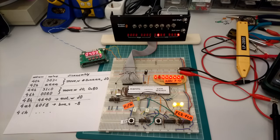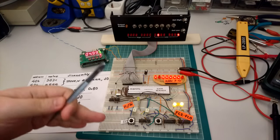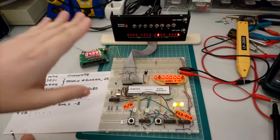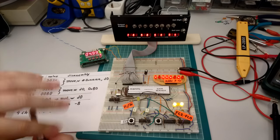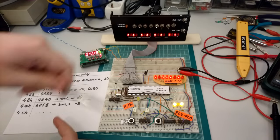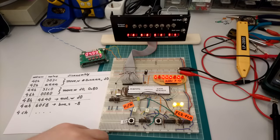What happens is that while entering an exception handling procedure, the CPU will push a bunch of values onto the stack to save the context of execution at that point, so that after handling the exception, if we have a full operating system running on this thing, we could still go back and continue the execution of our program. In this case, I'm just going to fast forward through this because it's going to store a lot of values into the stack. So another store, you see that it actually stores the registers. That should be the value of the D0 register. It stores the whole execution context of the processor, so that it can be restored afterwards.